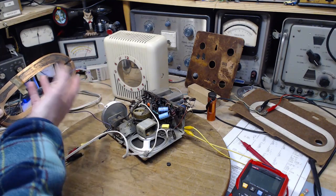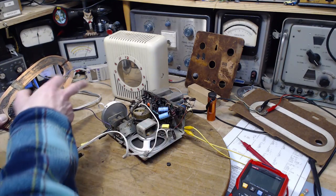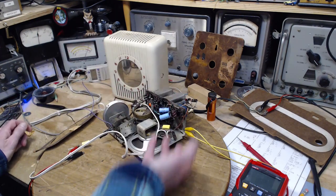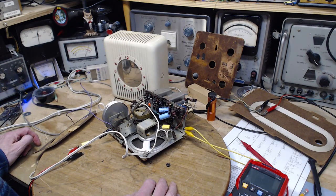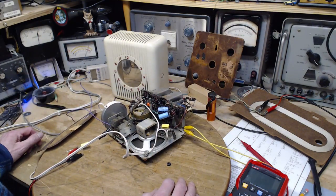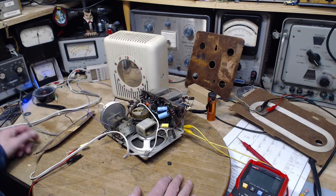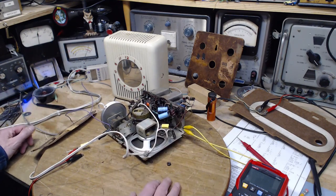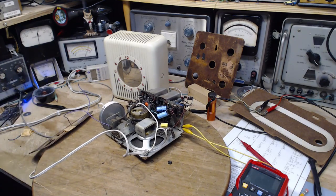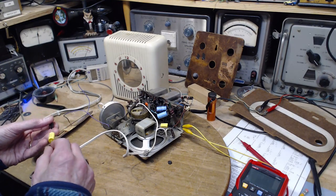Right now, only one wire is connected, so the situation is different. But when this is connected, it's a loop. It's sitting close to the radio. The radio may be spitting out enough output from the IF to be caught in the antenna and pushed through again, only to reappear as an oscillation. So it's possible the antenna is the problem. Now, like I said, the antenna is disconnected, so you wouldn't expect any oscillation now. So I don't really have a good sense of direction with this radio.